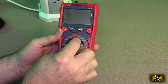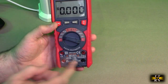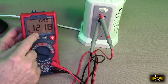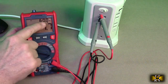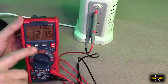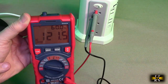When you first turn this on to voltage, you notice that the jacks start blinking — it's telling you where the leads have to go. I have it on voltage, hit the function button to go to AC, and you can see I've got it across my 120 volts — it's showing 121.67 volts and 60 Hz, so it's actually giving me the frequency coming to my house. At this higher voltage, the screen goes red to let you know you're measuring a higher voltage.